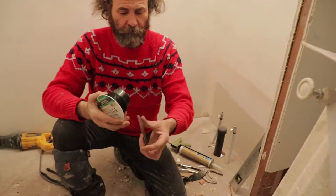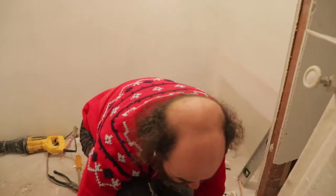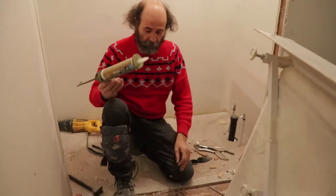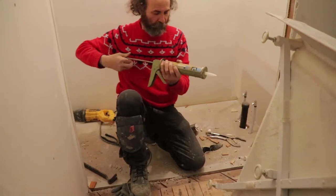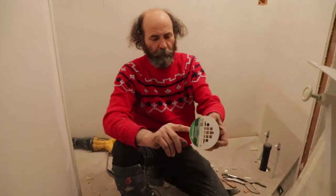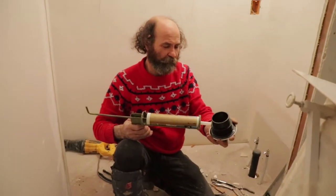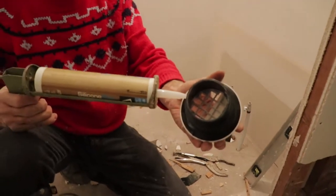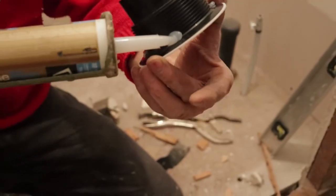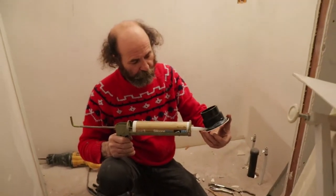The way it goes: we put the rubber gasket and then the paper gasket — that way it doesn't lose its shape. I'm just gonna use some silicone just to have the extra protection right there. The chance of leaks is just between this part and the shower itself, so I want extra protection. Don't be afraid to put a good amount of silicone in there. If you go over, just clean up — use some alcohol and a paper towel to clean the excess.